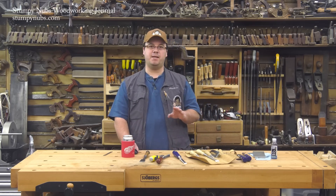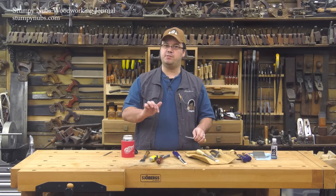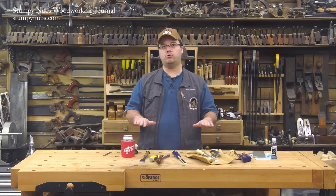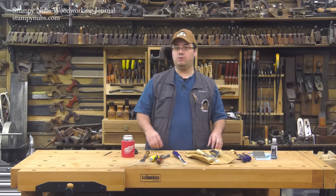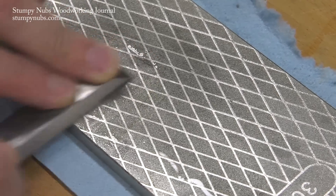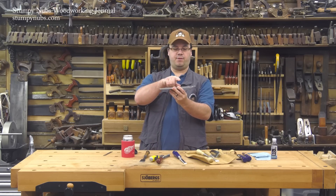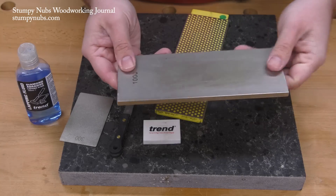Of course, you can't make a tool flat if your sharpening surface isn't flat as well — this is another cause of frustration for many woodworkers. If you rub a tool on a dished surface, your edge will come out shaped like that surface. If you sharpen with sandpaper, you're going to have to use tempered glass, granite, or something you know is perfectly flat underneath it. If you use water stones, you have to maintain them regularly — a lot of people re-flatten their stone after every sharpening. That's why for hand sharpening I prefer diamond stones because they stay flat without maintenance. I like the Trend stones because they ensure the solid steel substrate is perfectly flat within half a thousandth of an inch from end to end — that's twice as flat as the standards used by everybody else.